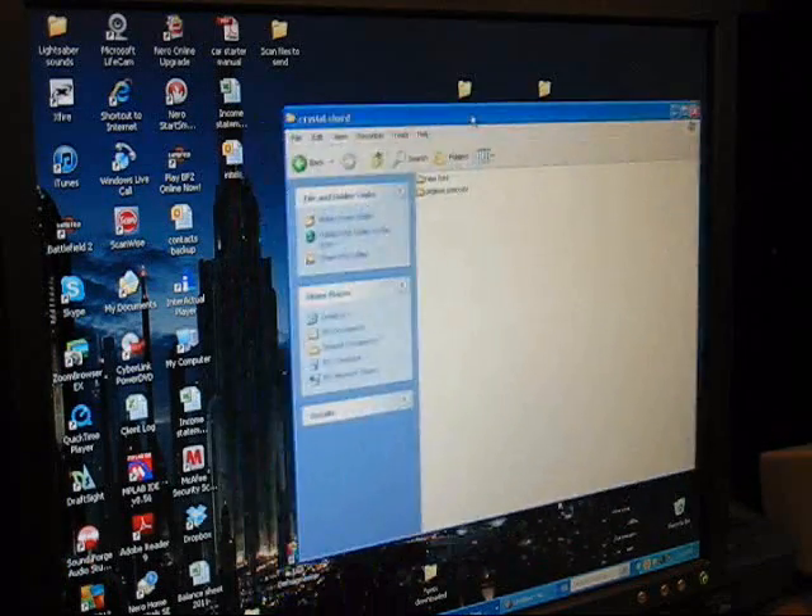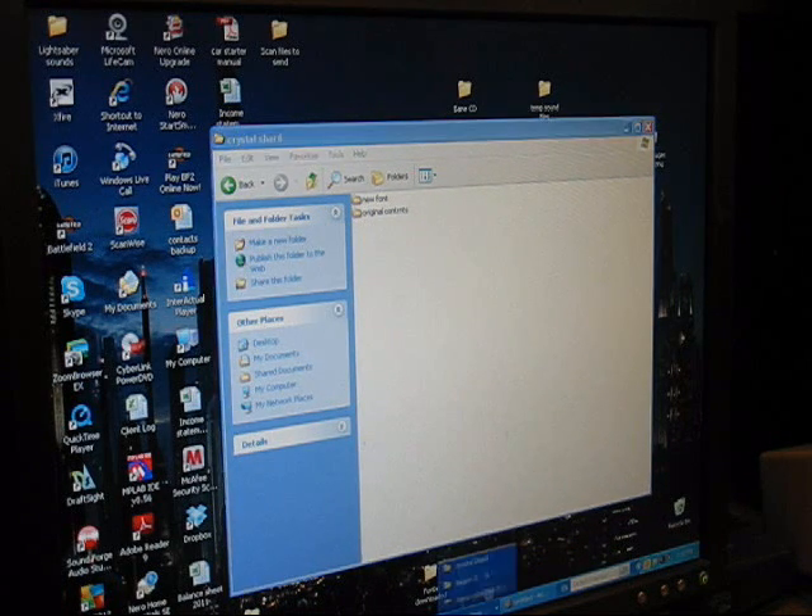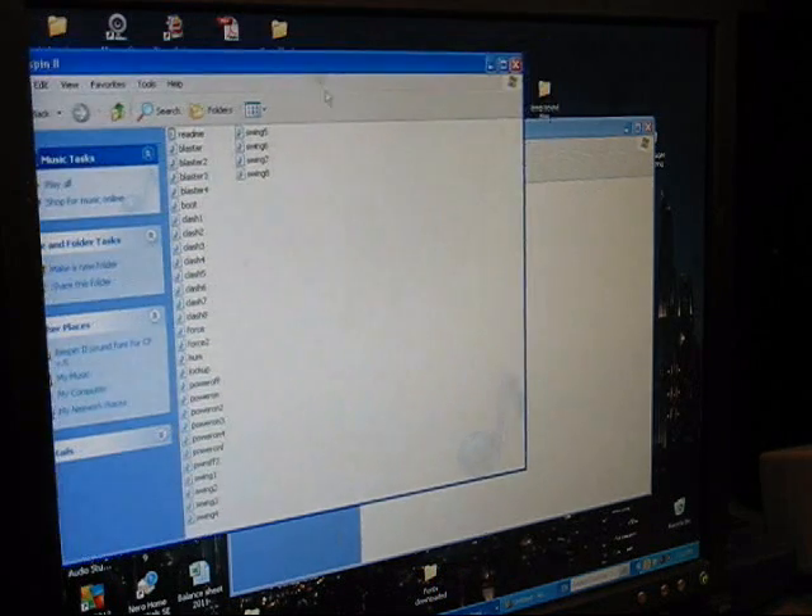Now you've purchased a sound font from saberfont.com and extracted the files, and when you do, it will look something like this — again, in List view. These are all the files, and you'll think, hey, that looks a lot like the SD card contents, but there's one major difference: in the files you've downloaded from saberfont.com, there will be no config file. That's as it should be, because you do not want to replace the config file — you want to keep all the settings the same.